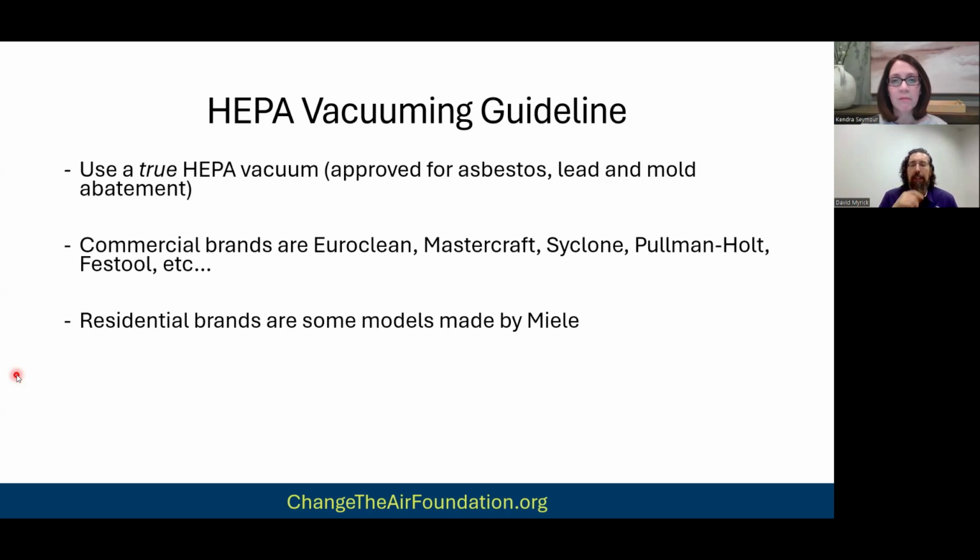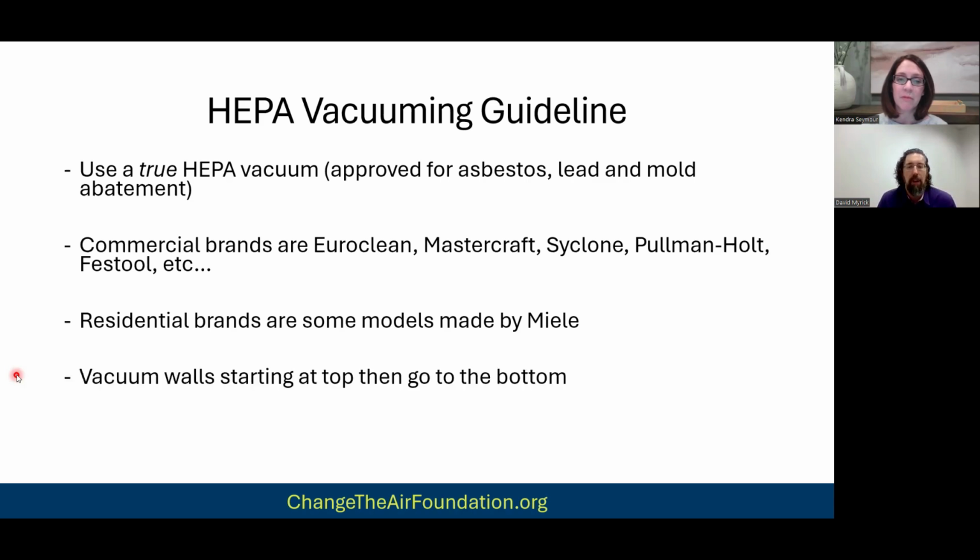And this is very misleading, by the way, because right now in the U.S. economy, when you got to buy a vacuum, all the vacuums say they're HEPA vacuums, all of them. And they're not lying. There is a HEPA filter in the vacuum, but it is not a true HEPA vacuum because it matters where the filter sits in relation to the motor doing the pulling, right? The impeller. And so in this case, I believe the filter has to sit in front of the impeller. So, you just don't know that unless you're going to break the vacuum apart or something.